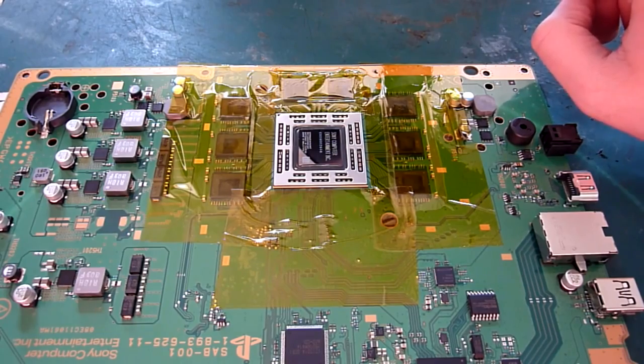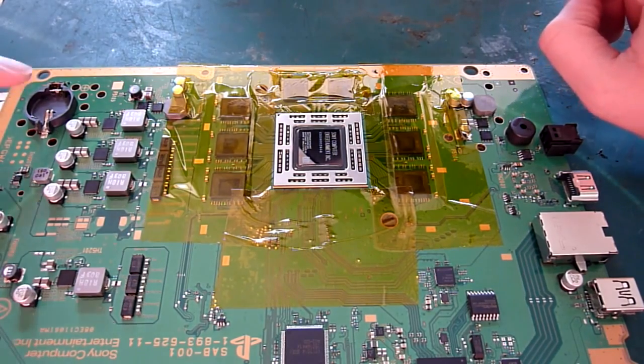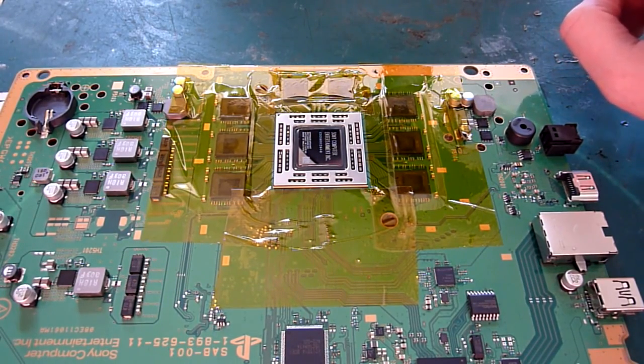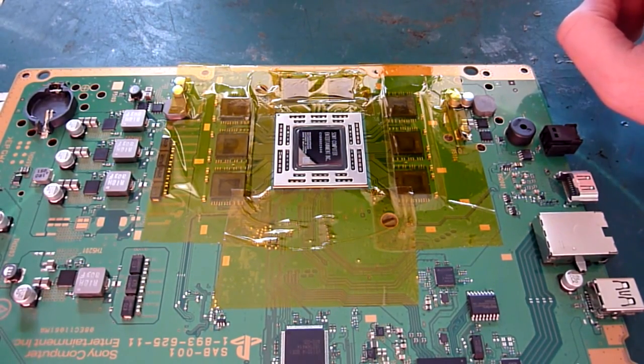We don't want that. The other big thing is, of course, over here, remember to remove your cell battery there, because those do like to go pop if you don't remove them, and it's not a particularly pleasant experience. It chucks bits of metal and loads of nice battery acid and everything else everywhere, and it goes with a bit of a bang and makes you jump, so I don't recommend doing that. Speaking from experience, once or twice there when I started out. So yeah, don't forget to remove that, whatever you do.